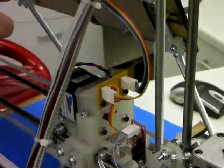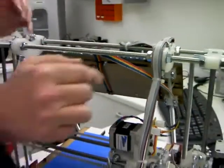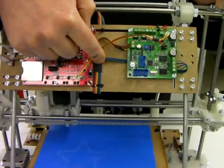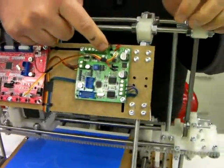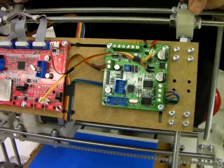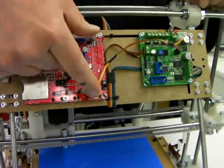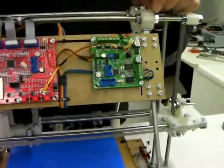I've put those into an eight-way ribbon cable that runs across here to the top of this board, down the back of it, held on by cable ties. The stepper motor connections run under the board and are connected to this connector here. The heater connectors are connected to this connector here, and the temperature sensor is connected here. The final connections in the entire machine are the data connections running from the motherboard to the extruder controller — these four wires that merge and then separate and end in these connectors there.